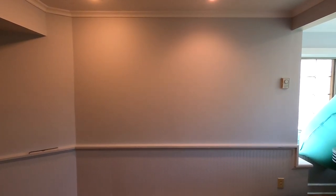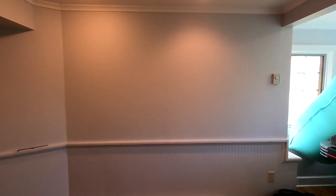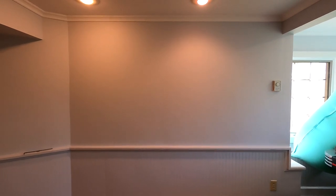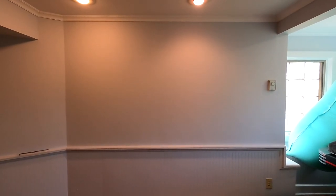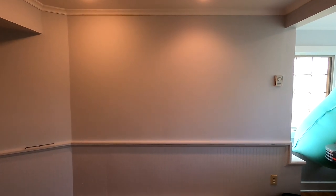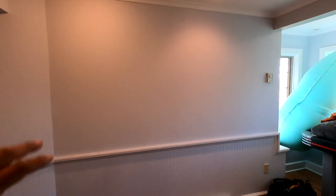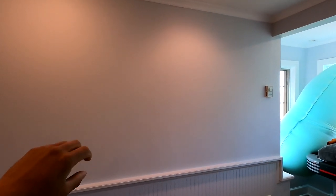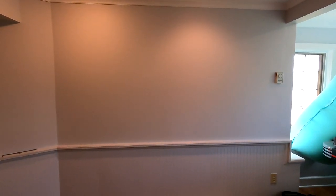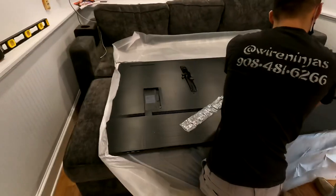I always guide them and make recommendations for the perfect viewing angle, but you respect what they want. What we like to do is measure the panel's height top to bottom, then have staff and the homeowner sit in the seating. Depending on the distance, the height of the seating, and the size of the panel, we spec out where center falls naturally — where are our eyes looking dead center to the panel. That's usually where the panel gets installed.